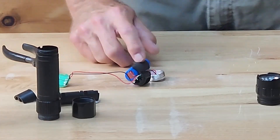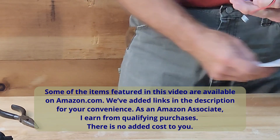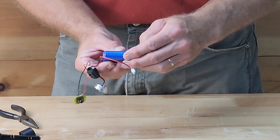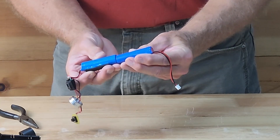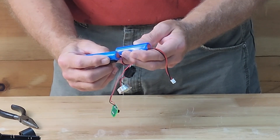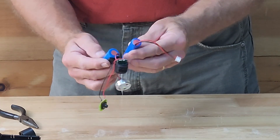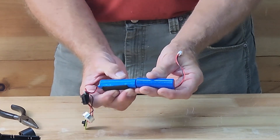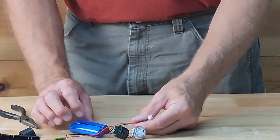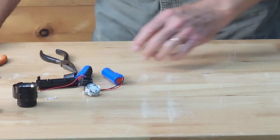So let me go shopping and see if I can find a place to buy one of these 18650s. I found on Amazon what I believe is going to be a battery that will fit this. This is a lithium ion 18650, 2600 milliamp hour. The original one was an 1800 milliamp hour. They're both 3.7 volts, so I think this will be a good back fit. It looks like the same diameter, the same length. It came with a little two-pin connector on the end which I don't need, but it has plenty of wire length. I need to get my soldering set up and just do a simple re-soldering on those.